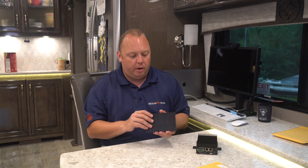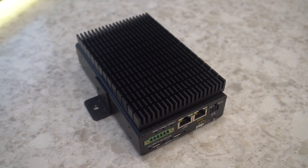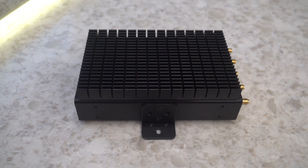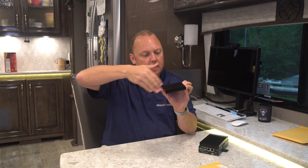So what have we created here? We have an anodized aluminum heatsink, and through all those ridges you can see that by creating this anodized aluminum heatsink that's pretty much the exact size of the Transit Series line, we've vastly increased the amount of surface area. Each one of these fins or vents is pointing up with ridges across them, and all of those surface areas allow the heat to dissipate more efficiently. Just like crushed ice versus cubed ice — crushed ice can get the water much colder faster because of surface area. Heatsinks work very similarly.